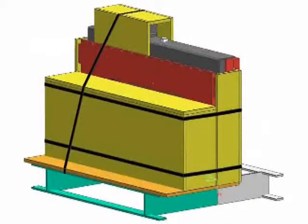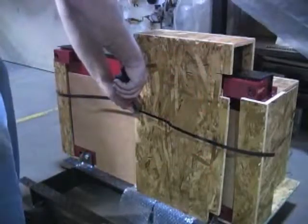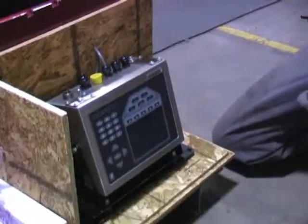The scale and indicator are shipped in an upright position for ease of installation, especially if only one person is installing the scale. Clip the metal bands that are encircling the scale and component box on the back side of the pallet. Also remove the wood pieces which protect the sides of the scale. To begin, remove the wooden cover containing the indicator.